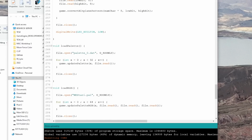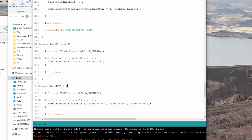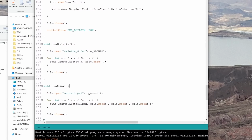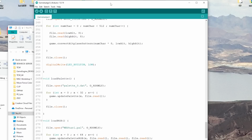is the development environment for Atmel devices. It's nice to develop in Microchip Studio since it's Visual Studio. However, you need a debugger or a programming device, in this case a UPDI programmer, Universal Programming and Debugging Interface. With the Pico, I was like, well, why don't we use Arduino? Arduino is not as pleasurable to code in. That's an understatement. However, it's pretty easy to get started with.